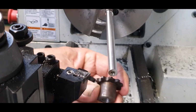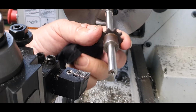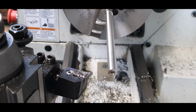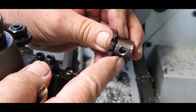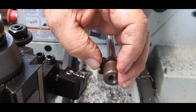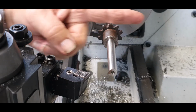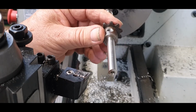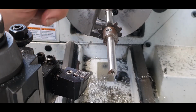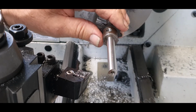That's our little sprocket gear which goes on that way. You'll see that can spin, that's not a problem. Oops, well, that's a nice thing to do, throw it away. Anyway, I've drilled the hole in there and that's ready to have a grub screw. So that will go on, there'll be a spacer on here and then the main carrier block, whatever you want to call it, then that'll be spaced out. And once I've got the chain on, I'll give it a couple of revolutions, because the chain will also line it up. Then I'll put the grub screw in there and tighten it up.